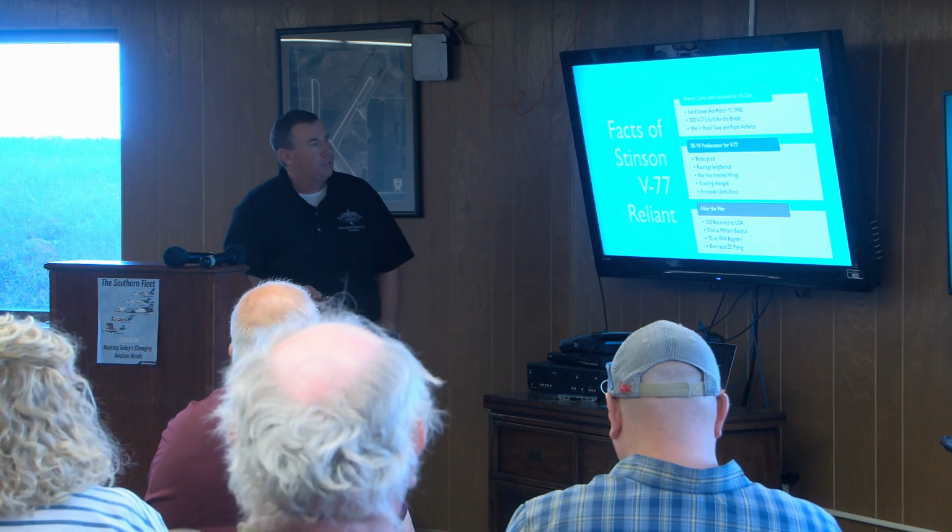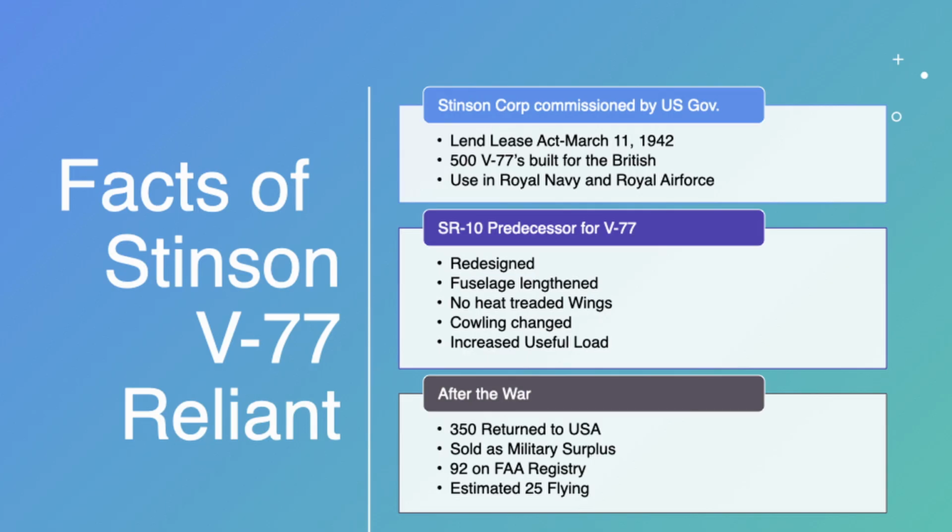But I'll just start off with some quick facts. This isn't all of them, but to give you a background of the V77, and Randy, you can set me straight if I'm wrong on this, the Stinson Corporation was commissioned by the U.S. government to build 500 of these, and this was part of the Lend-Lease Act in 1942. They went into the Royal Navy and the Royal Air Force for the British. It was the predecessor of the SR-10, so they redesigned and improved the SR-10, lengthening the fuselage, and the wings aren't heat treated like the SR series, and changed the cowl a little, and then they also increased the useful load.